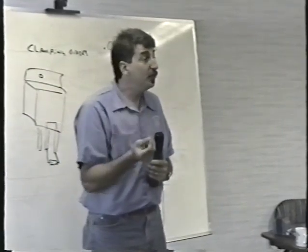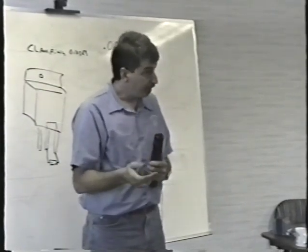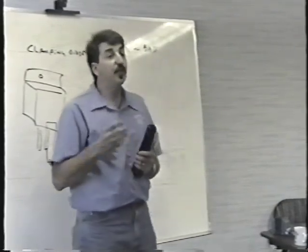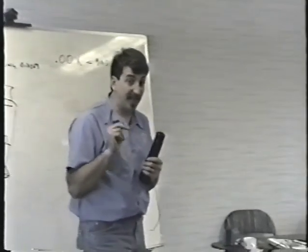If the fuse is not blown, you really have a pretty simple problem here most of the time. And there's really only a couple of things that commonly do that: the plus 12 volt output diodes and the minus 5 volt output diodes. So let's see if we can find those guys. Where's that power supply, Wayne's power supply that I was messing with? The one with the shorted capacitor. Is this the one? Yeah. Okay.